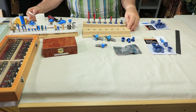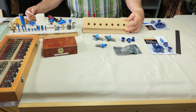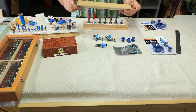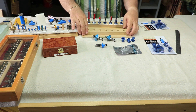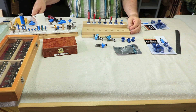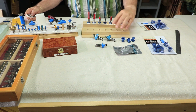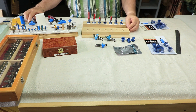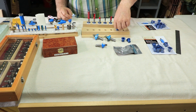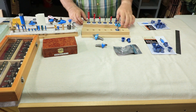I got that center-finding ruler from woodsmithshop.com, though they're probably available from a lot of resources. I drilled these holes to five-eighths inch as per the instructions for the inserts. I also cut a piece of quarter-inch MDF four inches wide and 12 inches long to give a base for more stability. After cutting and drilling, I glued these pieces together — it holds really well just with the glue. Now I can press the inserts into place — just take an insert, press it in place, and it's a snug fit.